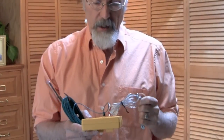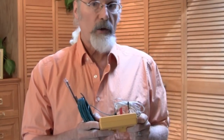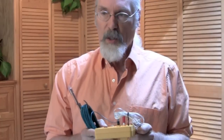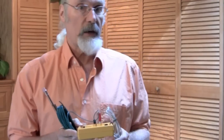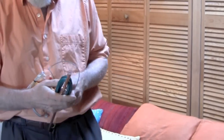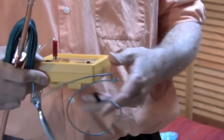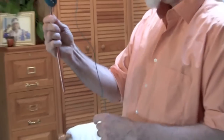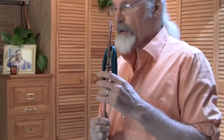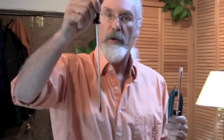One of the most important things for this test is the meter has to know what zero volts is. We don't want to use an electrical outlet grounding, as that leads to inaccuracies. We wouldn't want to use a water pipe either, because sometimes there's a little electricity even on water pipes. We want to go to the earth itself. Different kinds of ground rods can be used — sometimes something as simple as a screwdriver in the ground with an alligator clip. All of that is good.